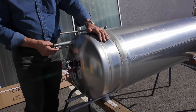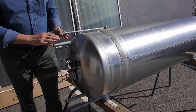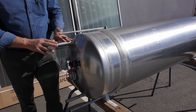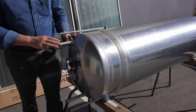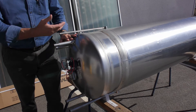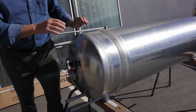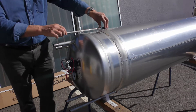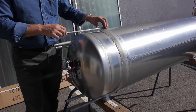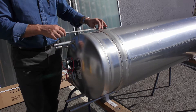On this side is the pressure temperature relief valve connection. One of the things you'll notice with our tanks is that we have a separate PTR valve discharge connection as opposed to the main hot water outlet. This stops nuisance discharge in summer months when you take water out of the tank and hot water flushes through the lines and hits the wax stem of the PTR valve. Above this is our jacket venting valve, used to ensure the pressure in the mantle from the heat exchanger is always maintained at a constant pressure no more than 100 kPa maximum.